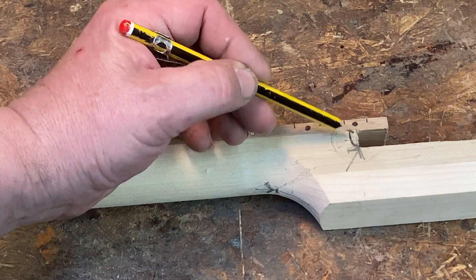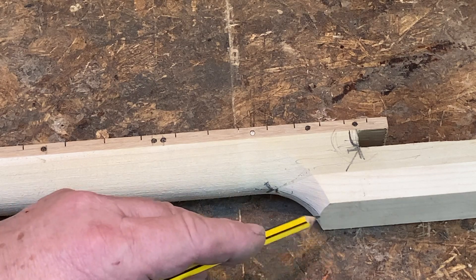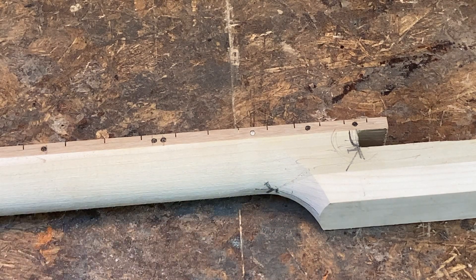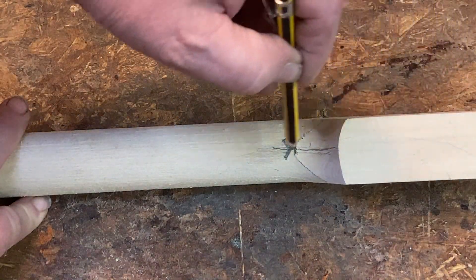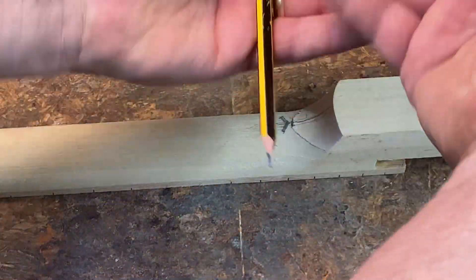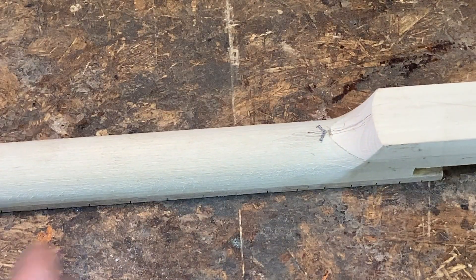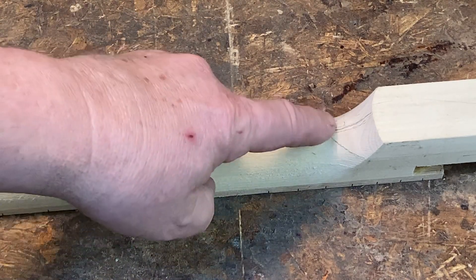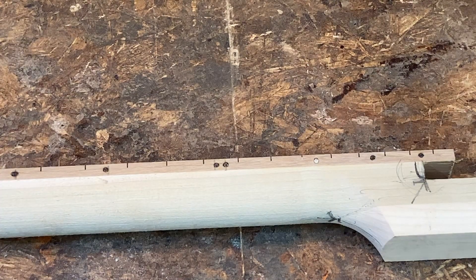To avoid that you can put a good radius on, but it didn't help here - we've got a nice big radius on here, as big as you could really, and it still cracked. My suspicion is it got bent one way and the two parts split in a rotation, because I probably walked into this section and just twisted it, and it was enough to start that crack.